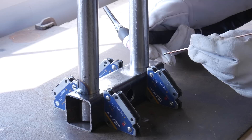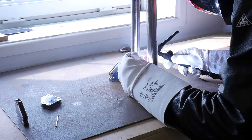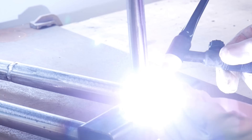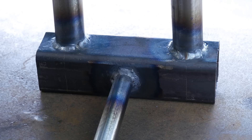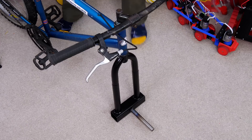Now we just need to weld those onto the piece of box section steel so that we can mount the axle through the other hole at 90 degrees. We've got that bit of bright steel bar which fits nicely through the hole which is 20 millimeters on the inside. A bit more TIG welding to fix that on — I really like TIG welding because you can concentrate heat in one spot without constantly feeding a wire like with MIG welding. I resprayed it black to cover up all the nasty welds, making sure that I masked off the bright steel bar axle and the top where it goes into the bike.